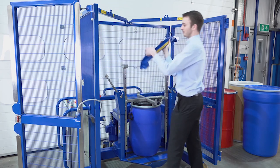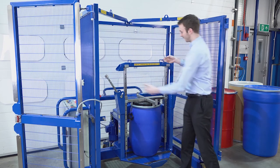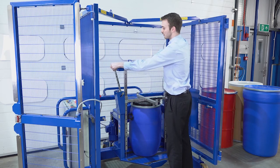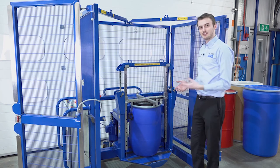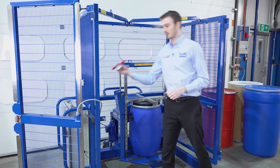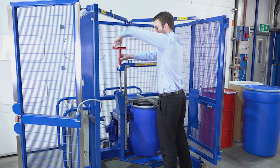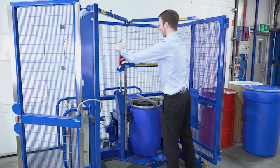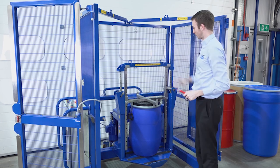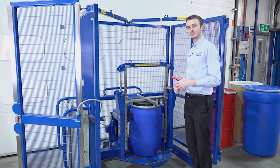The space at the top is where our top clamp bar goes. We take the top cross bar by the handles and place it on top of the small drum adapter. There are screws on the left and right — we lift each screw and drop it into place. If needed, we can loosen these screws for more slack. Using our tool, we tighten down the screws evenly on both sides. The force required is quite low — just nice and snug. Once snug, the cross bar pushes down on the drum, securing it in the head. We can now close the gates and begin mixing.